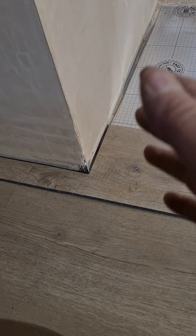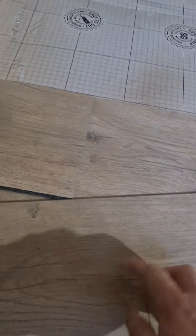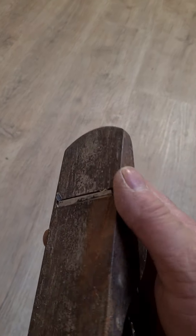I'm a bit tight here so I'm gonna run my knife down - I'd rather it's tight and then add the expansion gap rather than trying to get it right first time, because if you do it wrong you've wasted a whole length of board. This stuff is so easy to cut - literally a straight edge or set square, do a line and snap. For your fine little trims, use a small hand plane with a nice sharp blade to plane the ends off, get your gaps a little better and clean the boards up. That's vinyl click flooring - don't forget to like, share, follow and subscribe.